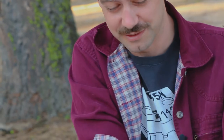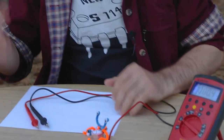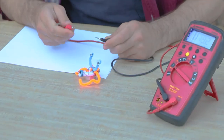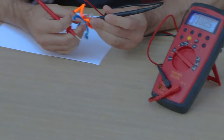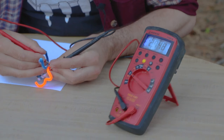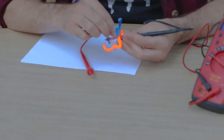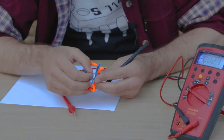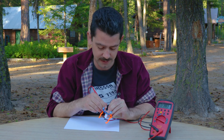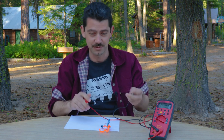Now let me show you the electronics secrets. This is a very simple circuit — just a battery and a motor. The source is the battery and the sink is the motor. Using a digital multimeter set to read DC voltage, the battery itself is a three-volt battery, though this one is a little old so it's only running at 2.75 volts. Interestingly, with the motor running, the battery only reads 2.14 volts because the motor loads the battery enough to drop the voltage. Voltage is related to current through Ohm's law: V = IR.